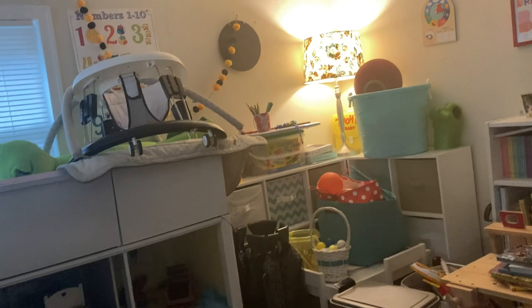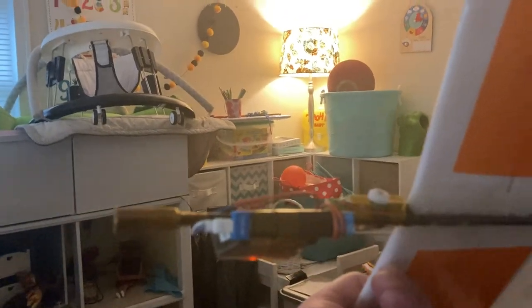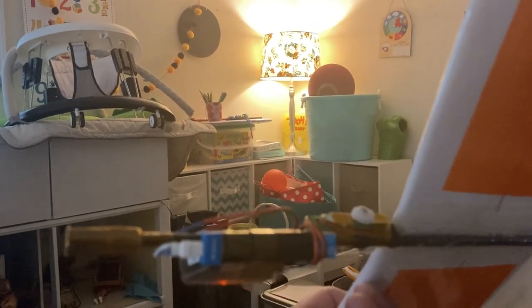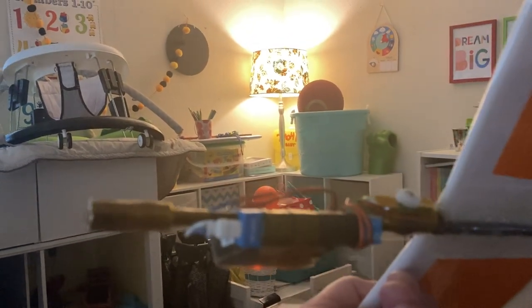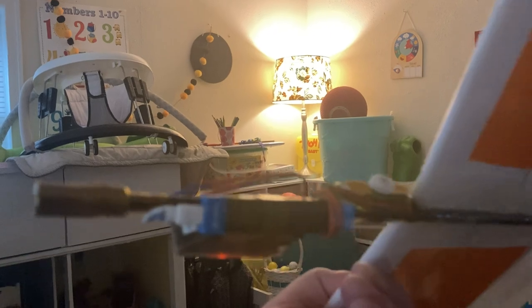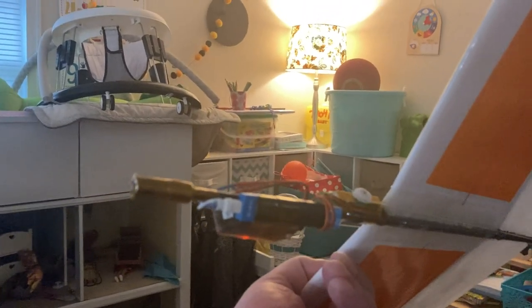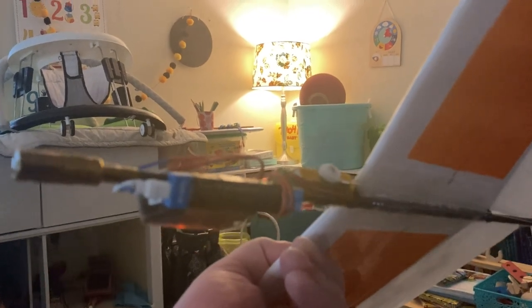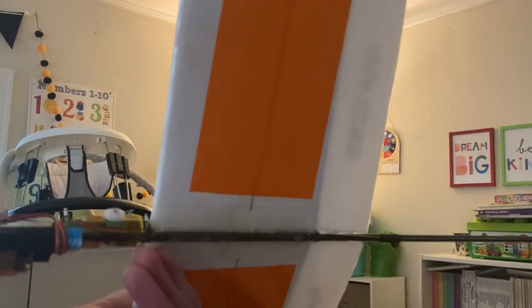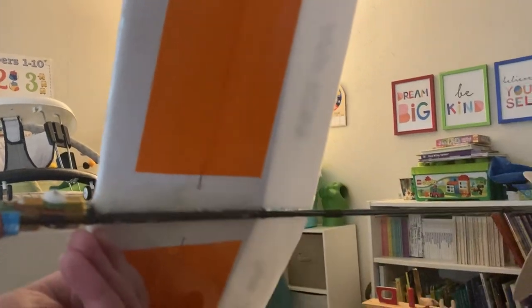And lastly, wife hooked me up with a new set of batteries. These are 1-cell LiPo HV batteries charged to 4.35 volts. And as per usual, I slipped it inside a formed piece of heat shrink tubing there as a holder. So it came together pretty neatly. Balances right on about, you see my black lines there, about 40%, which should be just right.